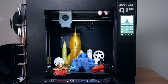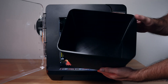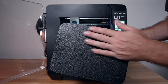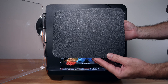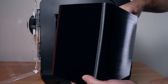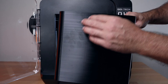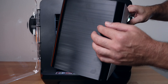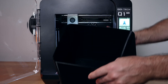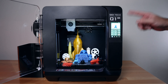We also have a really large PETG print - kind of like a trash can I made for myself. It was quite impressive how it came out: the bottom is beautiful, pretty much taking up the whole width. The walls look really good overall, though we had a little under extrusion and I can feel a little waviness through the Z-axis going up, showing some inconsistencies. Inside, the floor looks beautiful. It's very strong, so this is definitely going to be a useful little trash can.